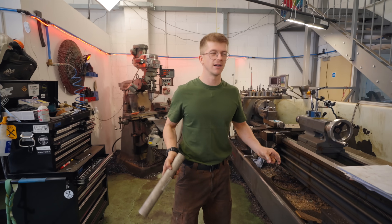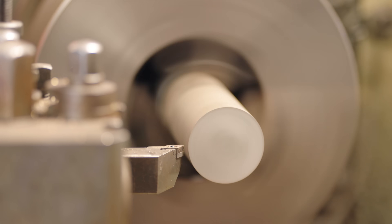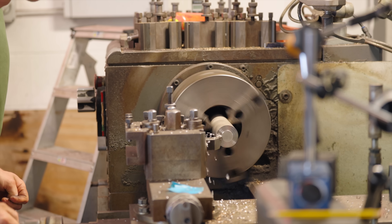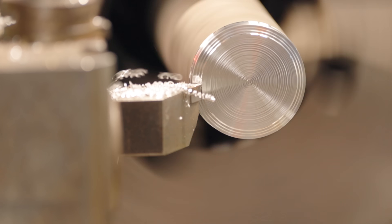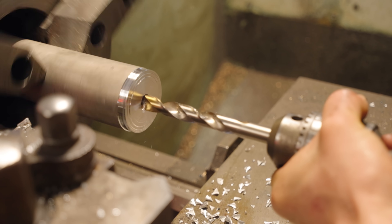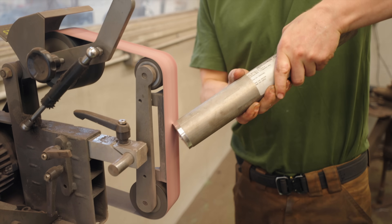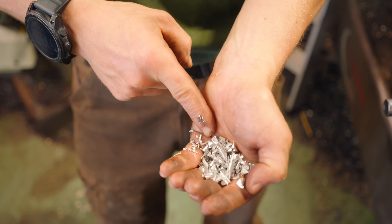Next question: machining. It's going to be a no-brainer. I'm just going to clean out the lathe of other chips. The fact that it can be cut so well with hand tools definitely shows you this is a material that you can really efficiently make stuff from. Big heavy cut on the end — let's see how it turns. Beautiful. I want a big long swarf. It just cuts like butter. It can obviously be machined in the mill if it cuts like that. No sparks — really easy to grind, basically like grinding a stick of warm butter. Clearly, magnesium is a beautiful metal to make things from because of how easily you can work it.